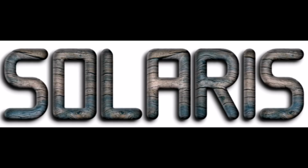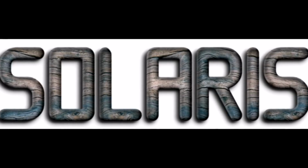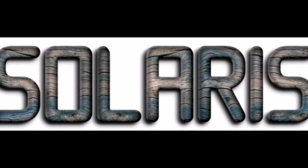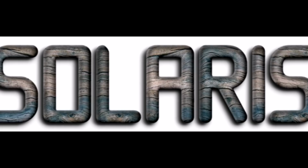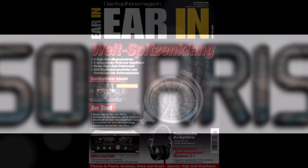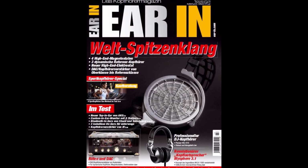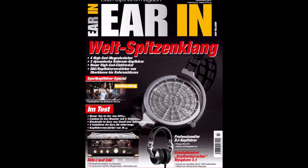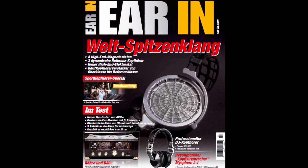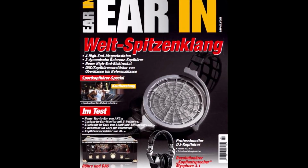The heart of the headphone amplifier from Castle, but of course, are the 4 solid headphone sockets on the front, which can drive all currently conceivable, high-quality headphones. In addition to 2 lockable combi-Neutrik jack sockets for 6.3mm plug-in XLR, the Solaris also offers connection options for 4-pin Sennheiser headphones, and a 5-pin Stax connector with bias supply voltage. For this report, mainly a Shure SRH 1540 is used, the current dynamic closed top model of the American manufacturer.